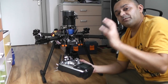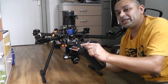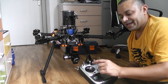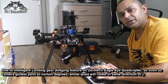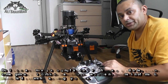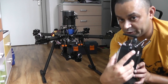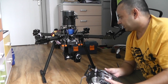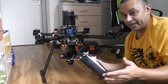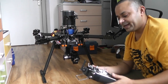Once you've arrived at a point where you want to do surveillance and use the zoom control, put switch E in the middle. Your rudder becomes your yaw control so you can pan the camera 360 degrees, you have tilt control on the elevator channel (channel 2, right stick), and you can zoom in and out using the slider. This lets you control the camera, focus on the target, zoom in and out, and get the footage you want.